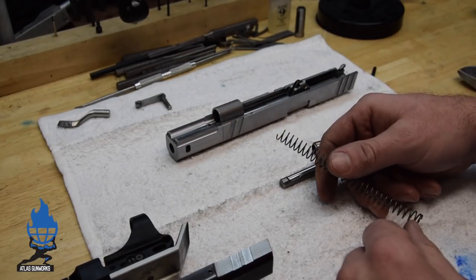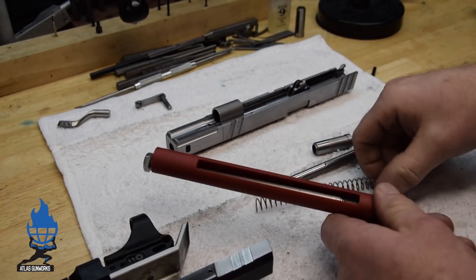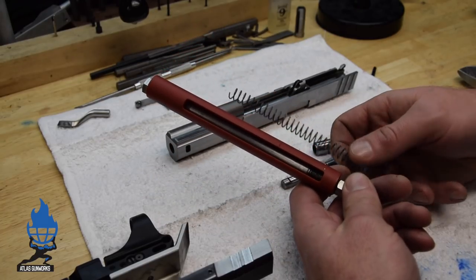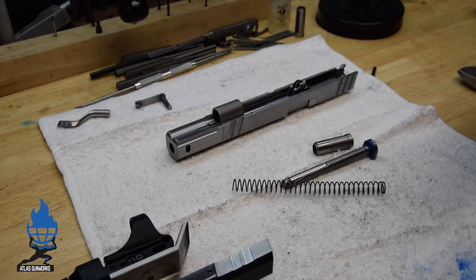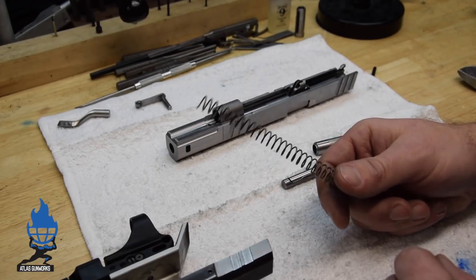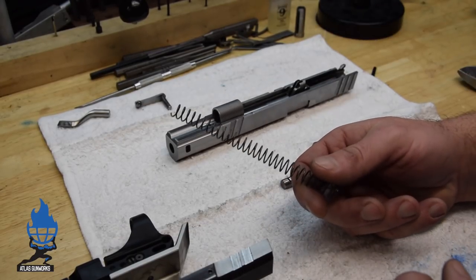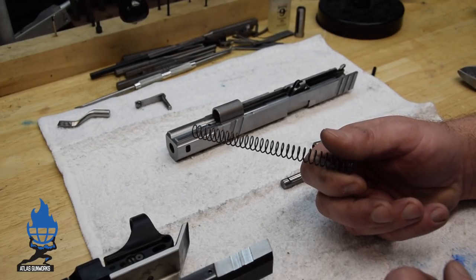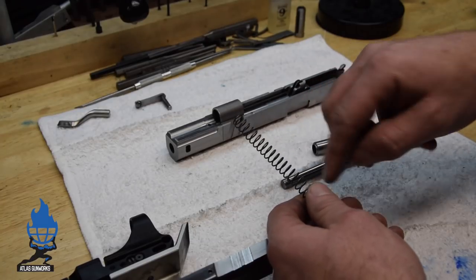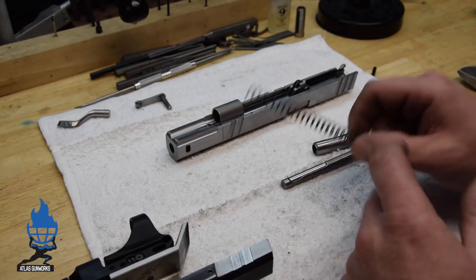The other thing worth every penny: Brownells sells a spring tester. Just because the package says it's an eight, or a seven, or a six, does not mean that is what it is. Invest in a spring tester — they're like 35, 40 bucks — and test every single spring. These springs wholesale for less than two bucks a piece; there's no way the spring company is testing each one. We buy these 100 at a time and if I gauged every one in the bag, they'd all be different. Sometimes when I ship a gun with an extra spring, I'll put a piece of tape and write 8.3, or whatever it is — they're all a little different. Don't assume the number on the bag is the exact number.